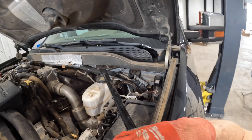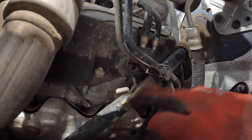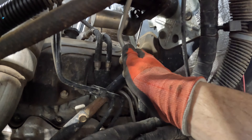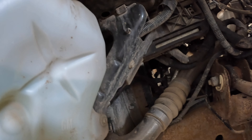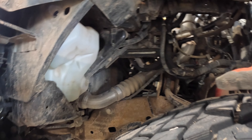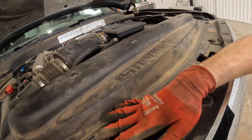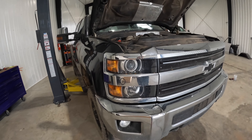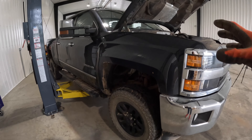You kind of have to hang it or strap it up somewhere when you lift - probably just strap it to this line here. On the inside there are just a few wires you need to unhook from the firewall, and then obviously the steering shaft bolt, power steering, and a couple power steering lines. On the front you're going to have to undo your intercooler boost lines, coolant lines, AC lines, and the transmission lines. So there are a few line connections, but once you pull this stuff off the front you can see all of it and it makes it pretty easy. I'll put on a time lapse and slowly disconnect all this stuff.